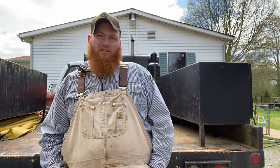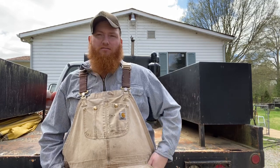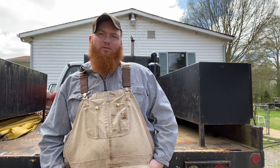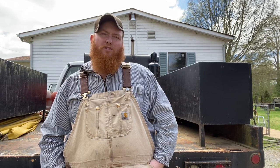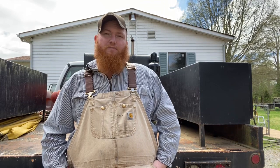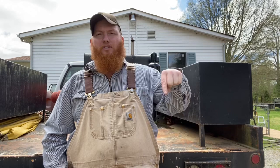It's got a cracked exhaust manifold, which is also the intake. It's made together, an intake and exhaust manifold. So we're going to take that old one off. We're going to get the new one set up and put on here, and I'm also going to do a video on rebuilding the, I think it's a Marvel Schebler carburetor that's on it, and I'll put the link down there in the description for how to rebuild those carburetors.